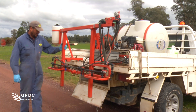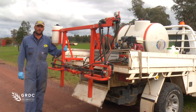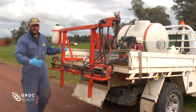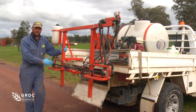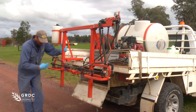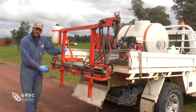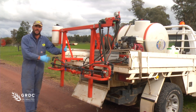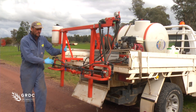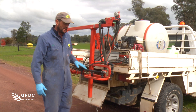Here's the dedicated fence line sprayer. I just want to go through a few of the points on this particular unit. Obviously I'm driver's side to the fence. I've actually put an underband nozzle which is cutting off square here on the crop edge and feeding back in there, so I'm not running into that half-rate issue going back out into the crop, which can potentially increase a little bit of drift. With 50 centimetre spacing, that's going to come into our calibrations a little bit later on.